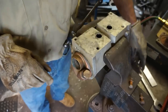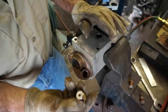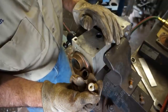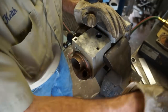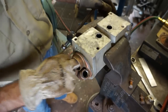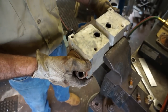Now, I think this is supposed to be a zinc anode on this side here. And yeah, where did it go? It ate completely off. And see, the thing is, if you don't get in there and change those things, they'll dissolve, fall off, break prematurely. Because I don't think they go like a wick all the way down. They go equally on all surfaces sticking out into the environment. And then a little piece might fall off, it might be a little chunk. Actually, by the time it eats like that, there is going to be a little chunk of something in there. All right, and then those pieces flow through, and you get the buildups like that.